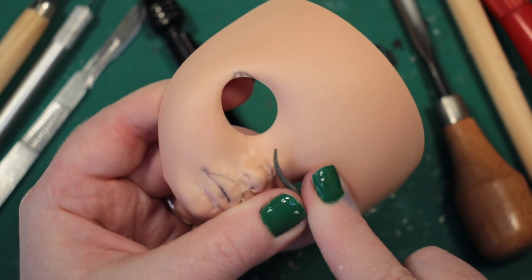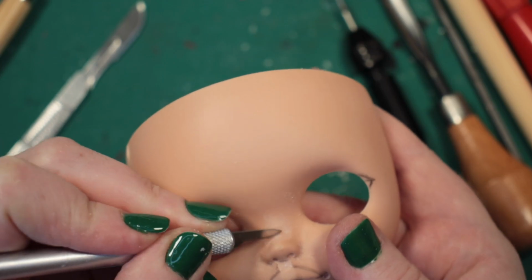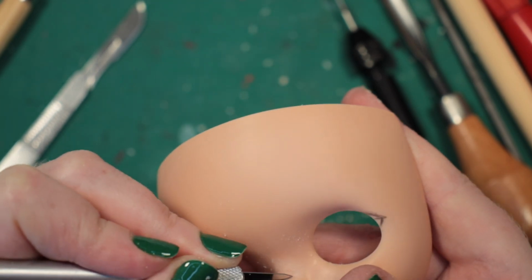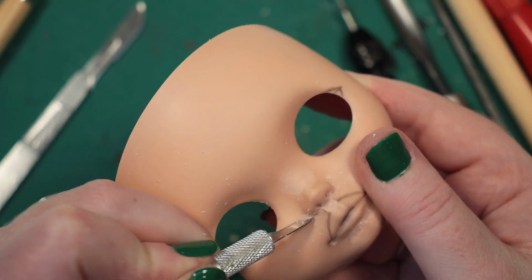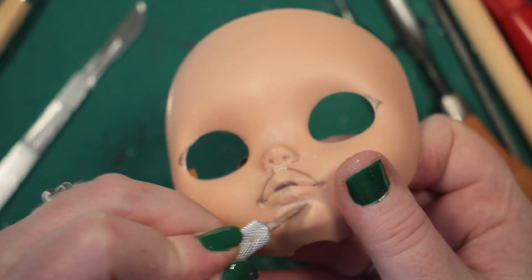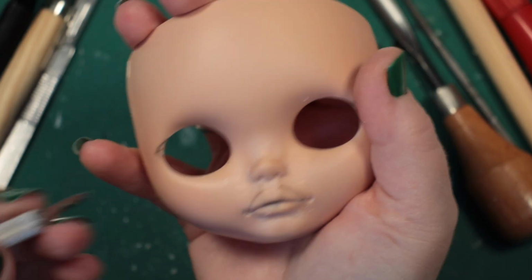The files in particular still can leave some messy marks on the face, so I use a curved scalpel blade to gently scratch and scrape away any of the deep gouges. It's important to change the direction that you're doing this with because this motion itself can leave little scratches and marks that all move in one particular direction and then can be quite obvious.